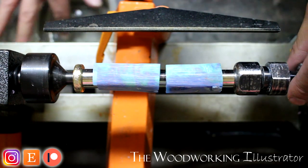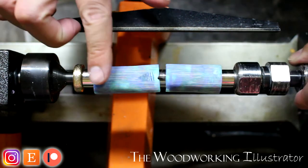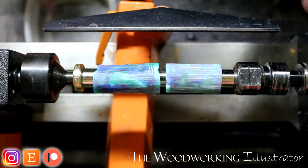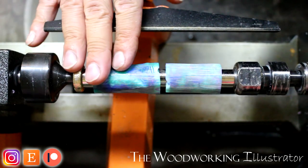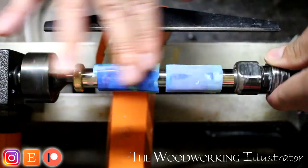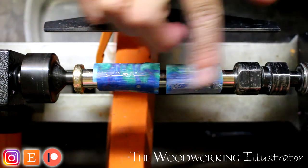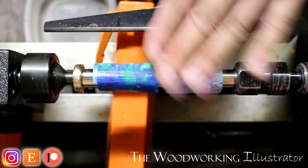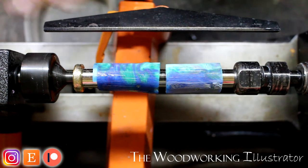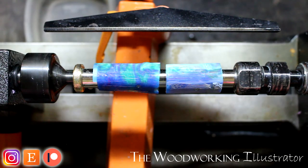And so what I like to do, since it's acrylester, before I start turning, after I use a really sharp tool that's been freshly sharpened, is periodically wet the surface a little bit. Because again, the dust is annoying, and I find it just helps it a little bit smoother. Someone else might find it different. This is just my personal thing. So as it's turning, I'll let some drops of water hit it periodically here and there. Again, everybody else has their own preference, but this is the way that I like to do it. Enough ranting. Let's get into this.